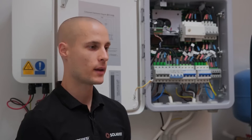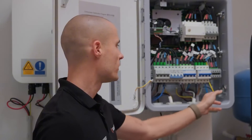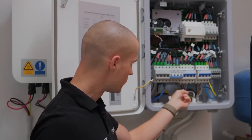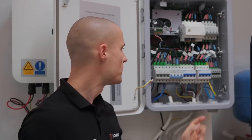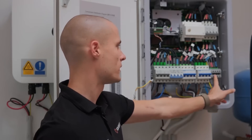To make this setup work, we need a specific wiring configuration that includes an inverter, the grid connection, and the backup side. There is a particularly important cable that incorporates five wires on both ends — three phases, a ground, and a neutral conductor. On the inverter side, the three phases and the neutral are connected securely to the circuit breaker. At the rear of the smart guard, there is a dedicated ground bar for both the inverter ground wire and the one from the grid. However, the protective earth conductor running toward the house must be routed directly to the PEN terminal, not the ground bar, to maintain safety and system integrity.